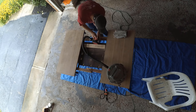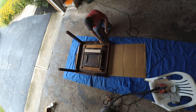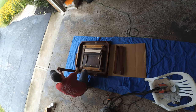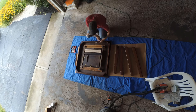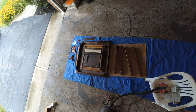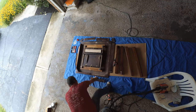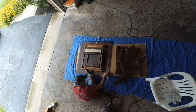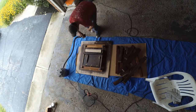Next, I decided to start working on the skirt of the table — that little bit that hangs around the edge — but I really couldn't get a good angle on it. That's when I finally admitted to myself that I was going to have to disassemble the table, and it's a step that I was really glad that I took. It wasn't as hard as I thought it would be — it was just a bunch of screws. I'd encourage you to keep little containers for the different size screws and also mark the pieces as they come off, so you know where they go.